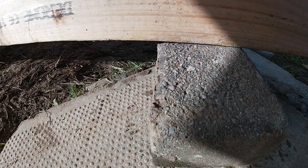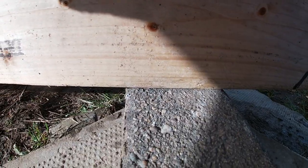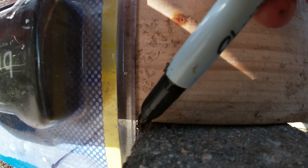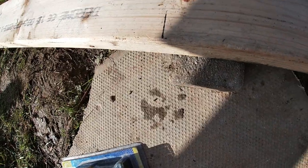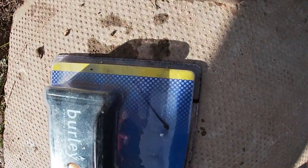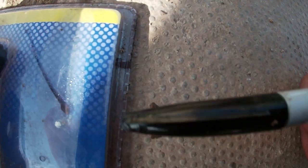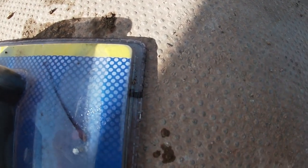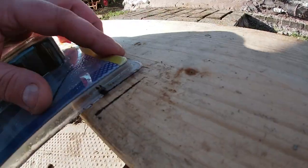For illustration purposes, imagine this is the top edge of your wall and it's at a slight angle. What you do is take a square, sit it up against the top of the wall like that, and draw a straight line to mark where you need to put the angle. Ideally you do this with a set square, but if you don't have one, find something hard plastic with a square edge. Then measure down one side how far you want the wood to drop down onto the wall — in this case I've got two inches — and put a little mark there on the edge of the wood.